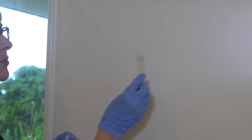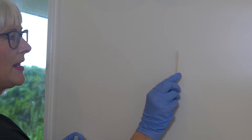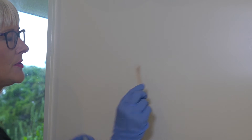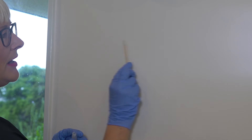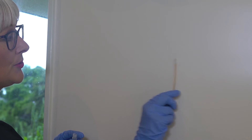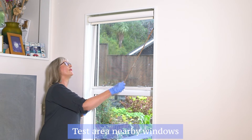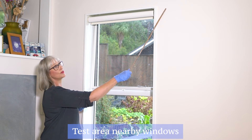When you're swabbing the wall, don't use the pointy end — use the side. You need to absorb as much of whatever is on the surface of the wall as possible. Keep the swab moist and cover a good area of the surface, turning the swab while you do it. It's also important to test window frames and joinery, walls and the ceiling.